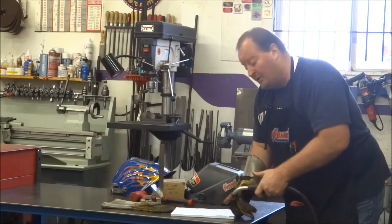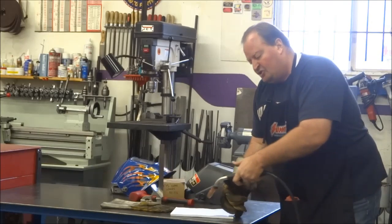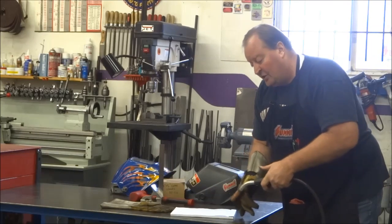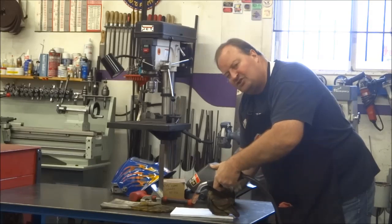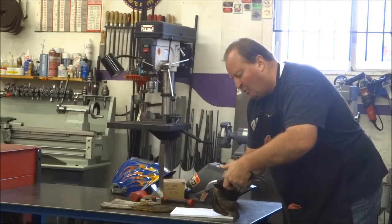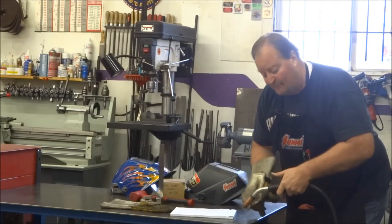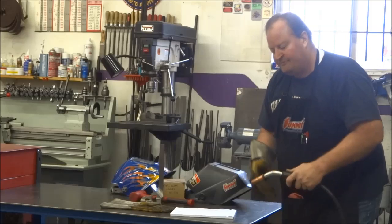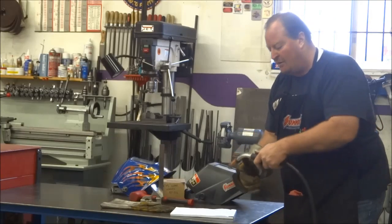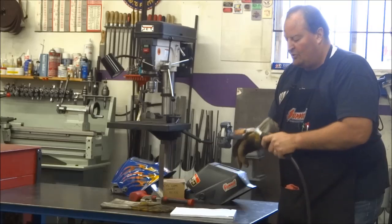As soon as I go up to pull up something, I'll take a dry run on it. Depending on how far you want to go, you want to see start to finish. If you can go start to finish, sometimes you think, well, I might have to reach a little further than normal to start, but then fairly early in the weld I'm going to be in a comfortable position, and then I end up coming back and I end in a comfortable position. If I can't do that, I'll break it up into halves or thirds or however, and then tie it in with my weld. So those are the two most common.